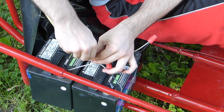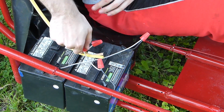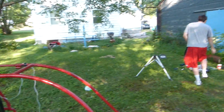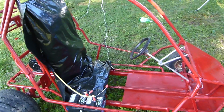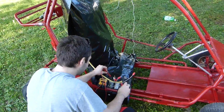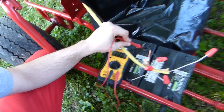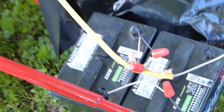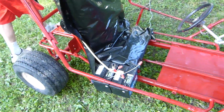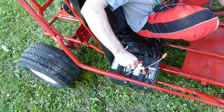You got the throttle? Hold the horses. Okay, let's be safe and grab the voltmeter to make sure we have 24 volts across the terminal. So we don't. We have 0. Most likely one of the connections is wonky. So we're just going to wiggle it and see if we get it to happen again. Pro strat. Oh, you know what? It's probably this one. If you don't think that's a good idea, say so in the comments.